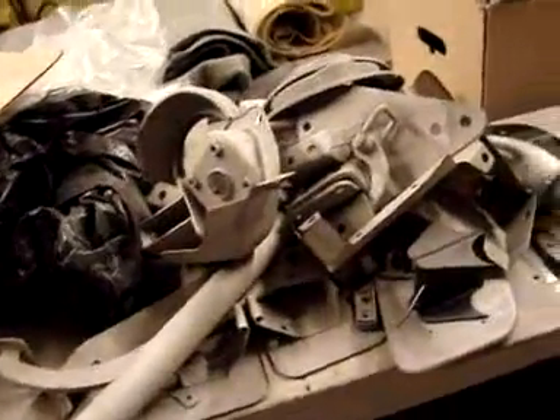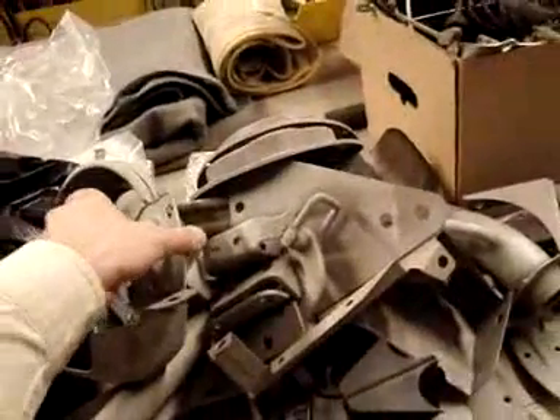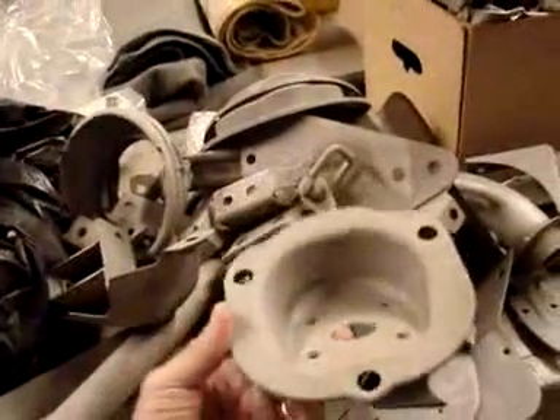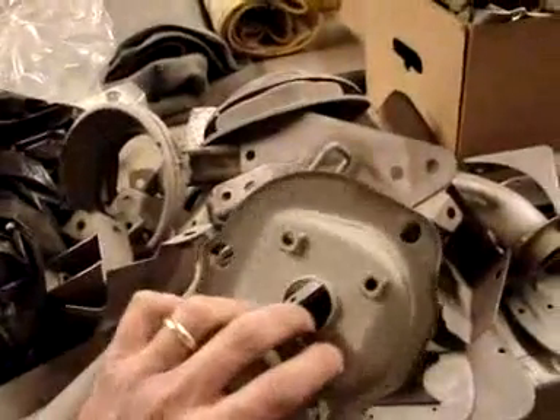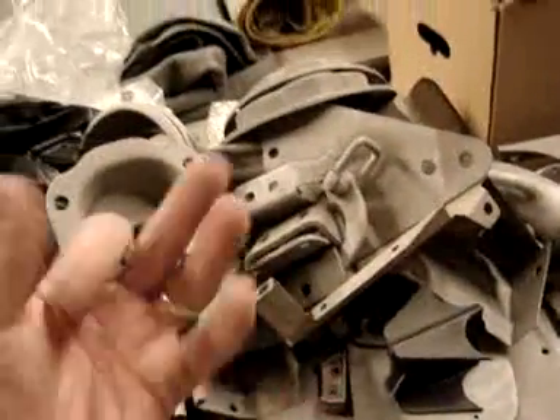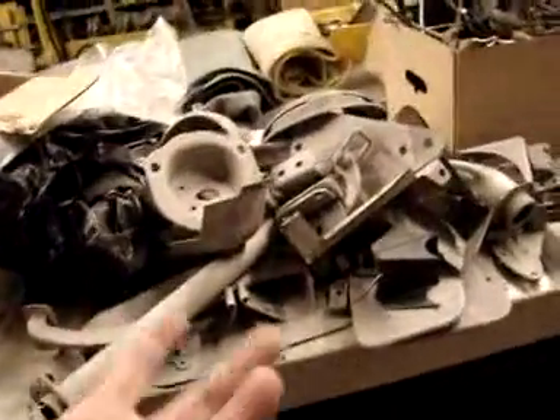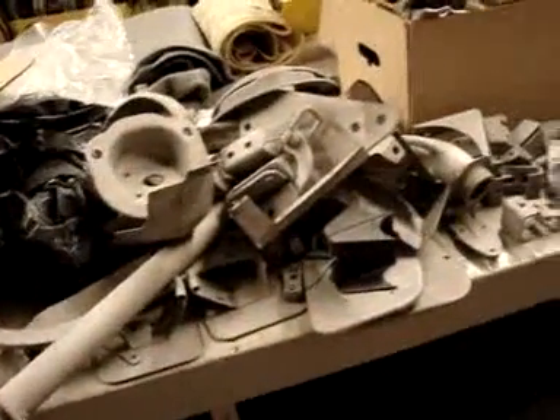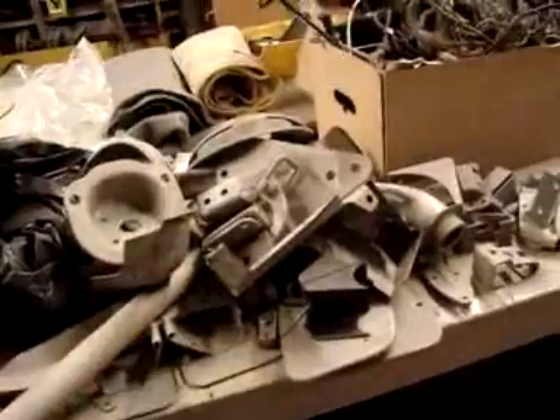and other stuff in color. Just want to show that he's been spending some time in what's called the glass bead machine. This is blasted with what's called aluminum oxide — it's a very good media to use. Not really using glass beads, but aluminum oxide stands up better, gives a nice smooth finish, and it's reusable — up to about 12 times in this machine, versus sandblast which can only be used once before it's pulverized, or glass beads which last about four or five times. So it's a very efficient type of media.